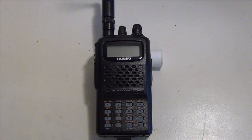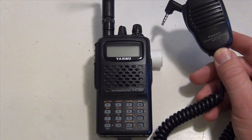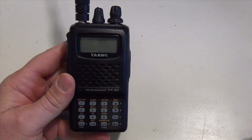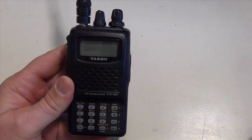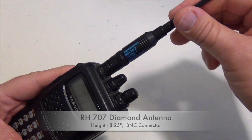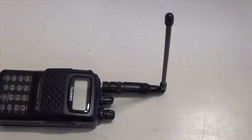There are a couple of really good accessories. I really recommend the MH-34 speaker microphone — it plugs right in, works great, and also works on the Yaesu FT-1D digital handheld. You can also get the FBA-25A dry cell battery case where you can put in several AA batteries in case you don't have access to a 110 outlet or 12-volt to charge the radio. I've also changed out the antenna to the Diamond RH-707 in BNC.